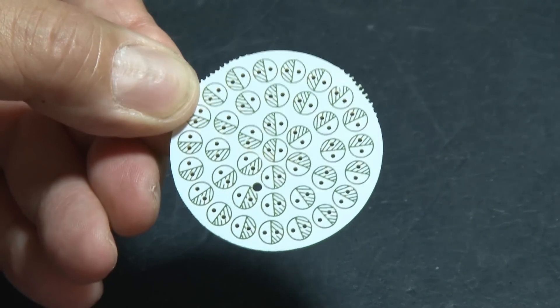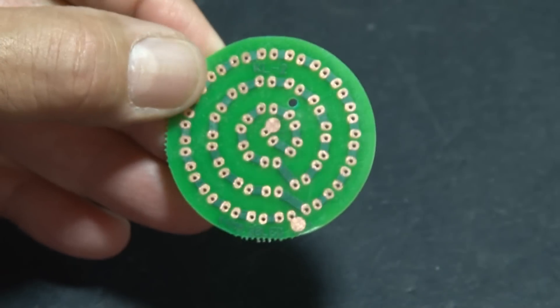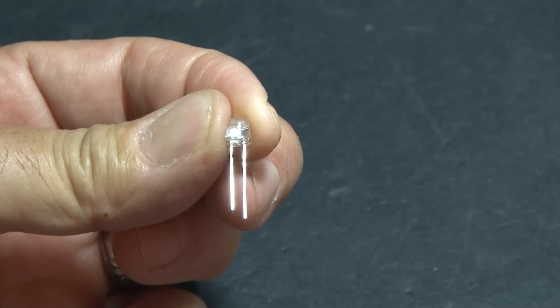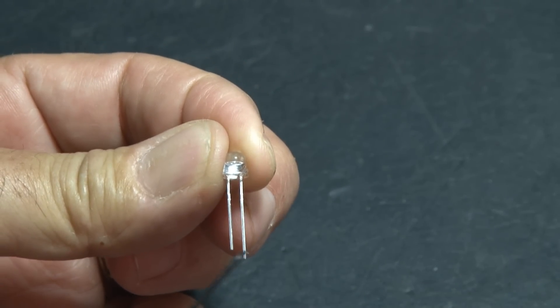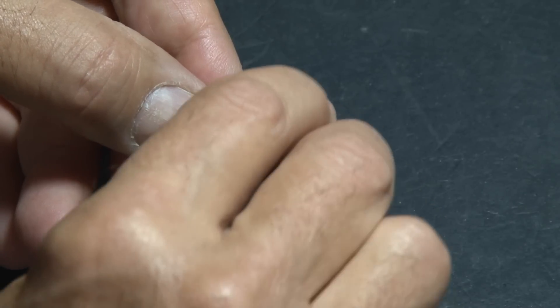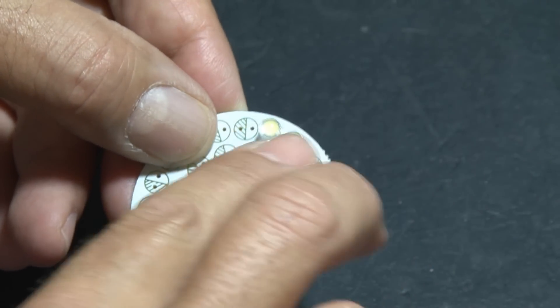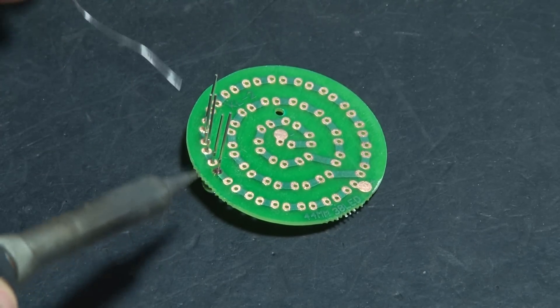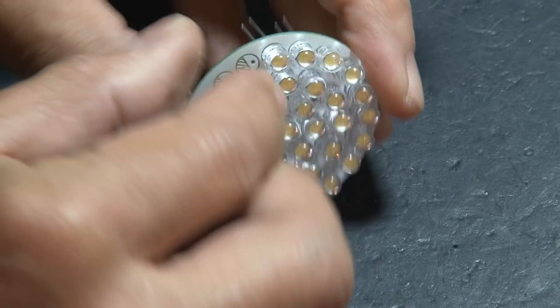This pre-printed cover has a complete layout for all 38 LEDs, showing positive and negative locations. And remember, with LEDs, the longer leg is positive and the shorter leg is negative. So it's time to start laying them in place on our printed board, and I'm only going to do a few at a time or else it gets really confusing. That way, if you do a few and you need to make some adjustments to make them straight, you can do that.